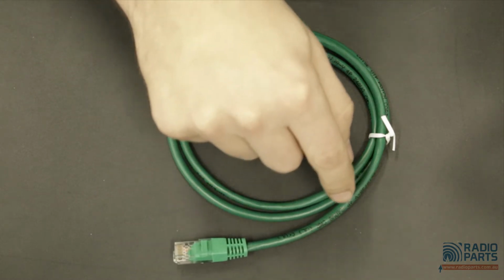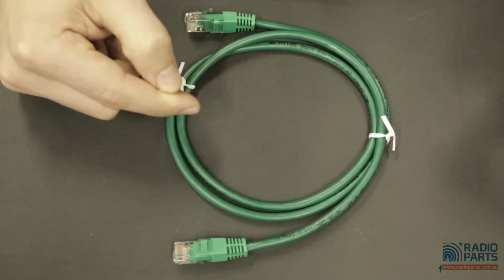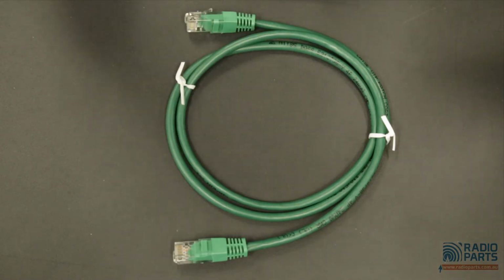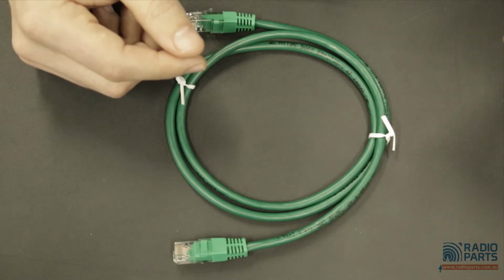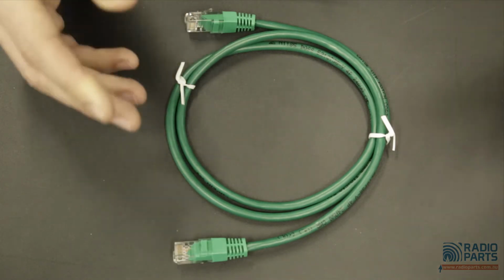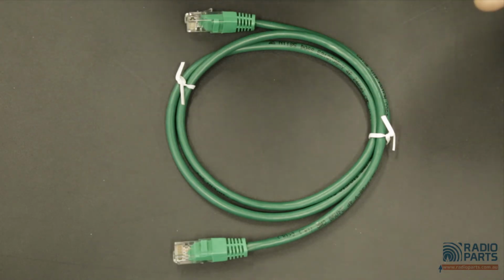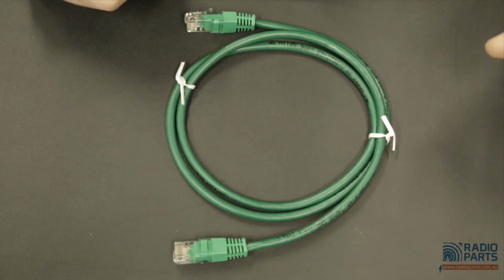Inside you've got the conductors. The cheapest way of making conductors is using something called copper-clad aluminium, or otherwise CCA, which actually, if you put it onto a DTX 1800, you'll find that CCA will often meet or exceed standards, not by much, but it will. The issue is, again, the durability. While aluminium is brittle, copper is malleable, and you'll find that through wear and tear and the pulling of the cable, the copper's integrity will be maintained while CCA will not.